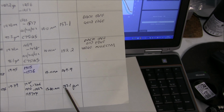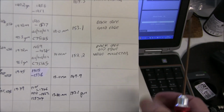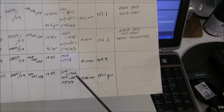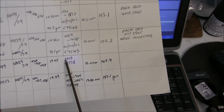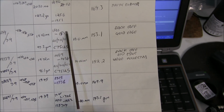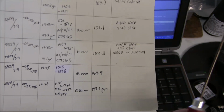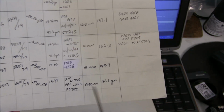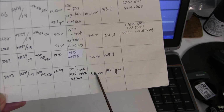The weight, 143.1, very lightweight. Again, it's 10 grams lighter than, say, the Surpass, and it's a little bit lighter than the Zombie. The rotor strengths, again, 1470. Slightly down on the Zombie, which was a nice high strength one. The Surpass, one of them I tested, the rotors vary. This was in the gold one, that was over 1500, and this one was only 1460 odd. So I think whatever motor you get might be high or low, but they all perform extremely well. Again, this rotor is the short shaft one, 13.8 mil.